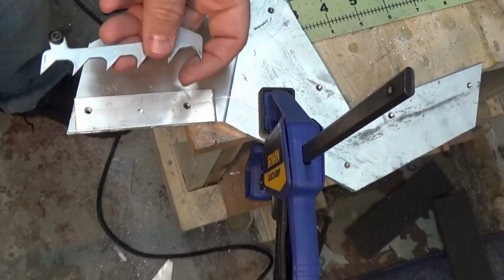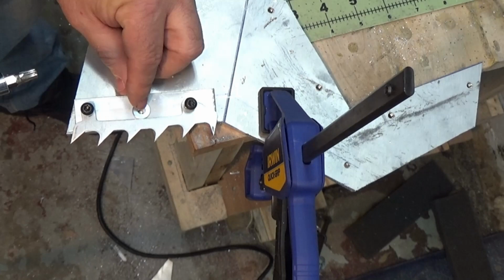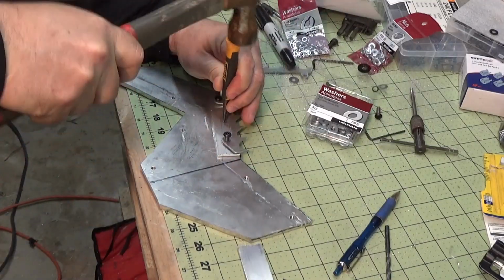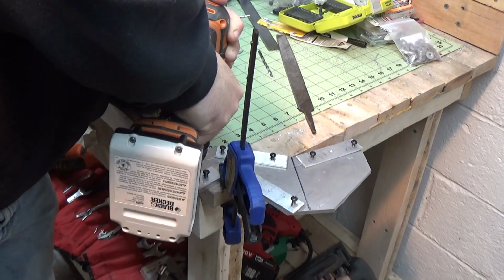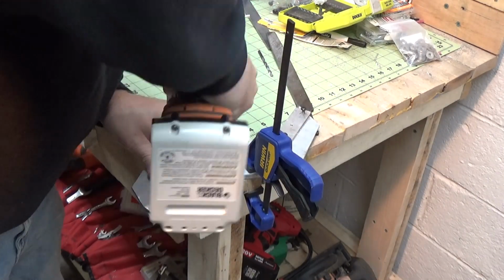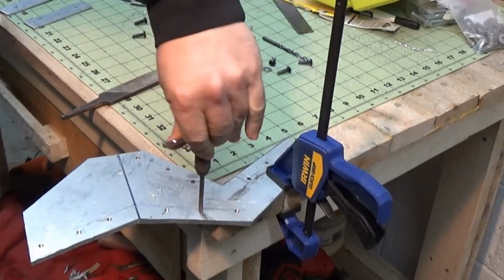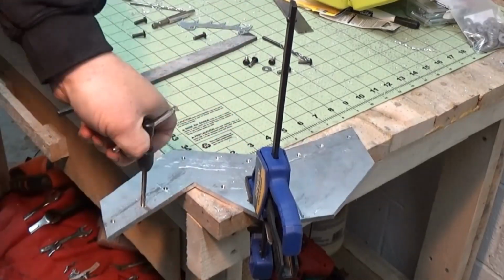Then lay one of the 4 pieces you just cut on top of the plate, followed by a chainsaw dog and two 10-32 bolts. Center a number 10 washer on the edge of the chainsaw dog. Then mark the center of the washer, center punch it, and drill it to fit a 10-32 bolt. Repeat this process for all the 4 plates. Now again, I drilled and tapped my holes with a 10-32 bit, but you really don't need to do that.